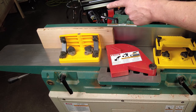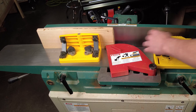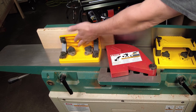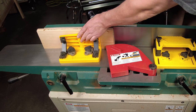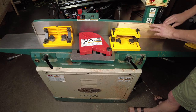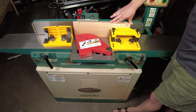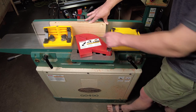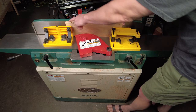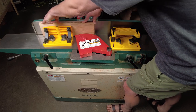On the outfeed side I've got — this is actually a resaw fence — and I'm going to be purchasing another set of feather boards. What this does is put pressure against the fence so my fingers don't have to be here. Now I'm already away from the cutter head at that point, but it just seems like a nice feature to have. All I have to do is keep my hand on the trailing end going over the cutter so it's only over there for an instant. The guard's working now, and as I'm feeding it through, I'm pushing here and pushing down with my left hand to have pressure on the outfeed side.